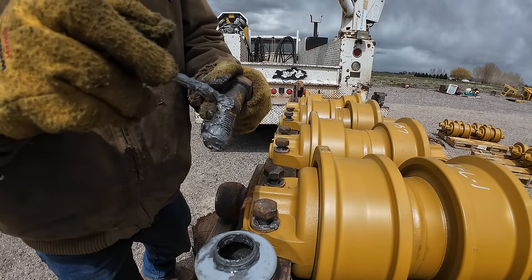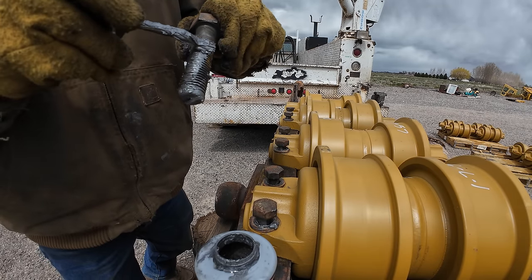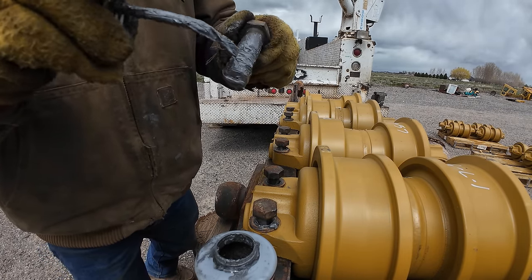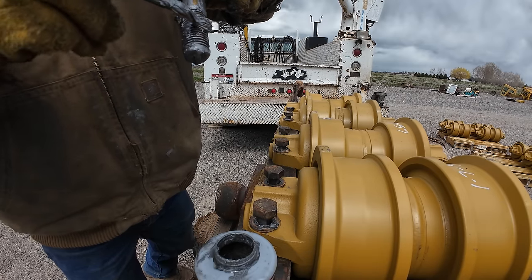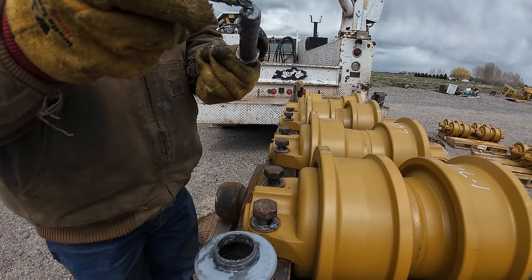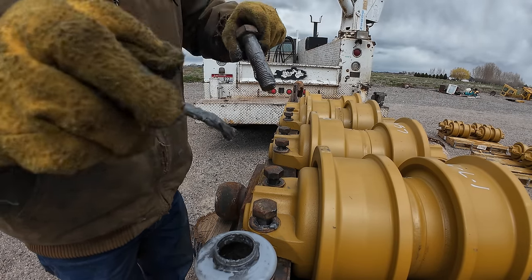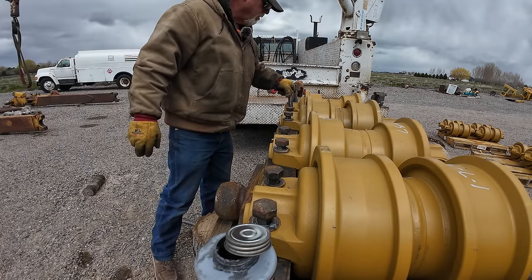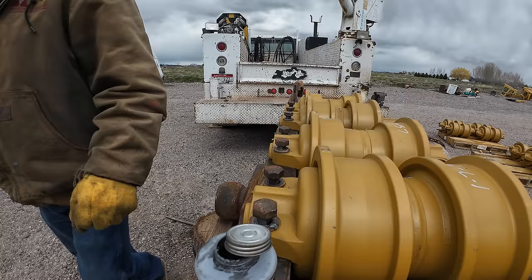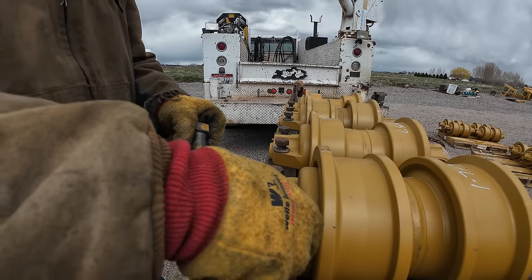Because when do you want less undo torque on a big 1-inch? I guess unless you were trying to tighten left-handed threads, but I suppose on truck wheels that would be the case. But since everybody's gone to those stupid clamp nuts, nobody uses bud wheels. And bud wheels have right-hand threads on the right side and left-hand threads on the left side, so your wheels don't come loose and fall off.